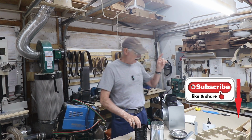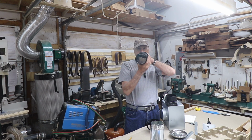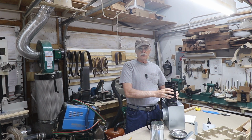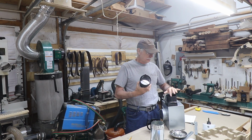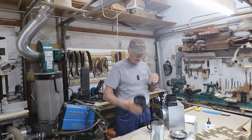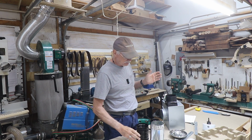First thing I did is I connected the fan, hooked this double wing damper up to it, and found that it doesn't cause any restriction at all. The damper that's in here is just this flat plate, no restrictive damper. It just opens up and then stays in the slipstream flat. So I'm good with that. So I'm going to put this damper and this damper belt and suspenders.